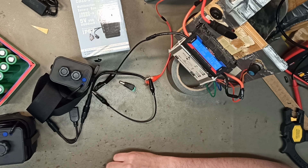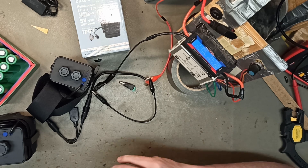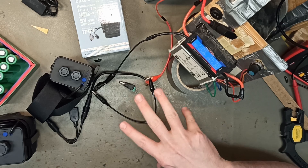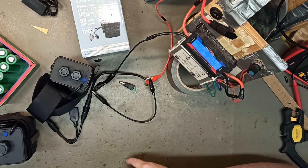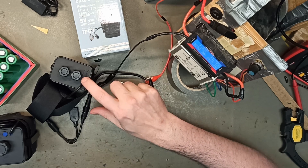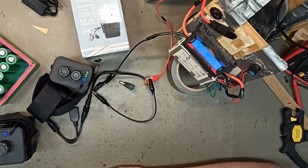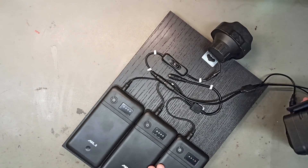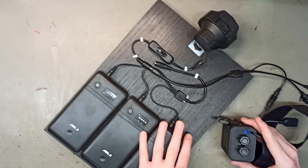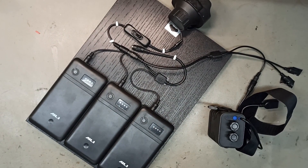I don't know if the cells are fully charged either. It's still pretty good — not the perfect 12 volt solution for high drain lamps, but definitely a good reliable 12 volt source with good water protection, an indicator, and USB functions so you can use it as a power bank. It doesn't get hot either. I decided to test if this product actually has a BMS, so I left two cells at 4 volts and one cell at 3.5 volts.